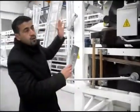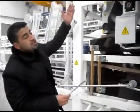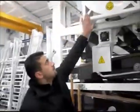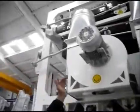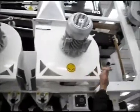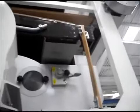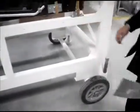Now the large oversized goes into the sack, and the seed which is separated from the oversized will go into the second screen, which is behind it. Maybe you cannot see it, but it is behind these aspirators, and your seed will be moving on the screen. At the same time, the small undersized impurities and admixtures will be removed, and they will be discharged from this tube into a tube which will take it to a sack located right here. When the sacks are full, you can change them.